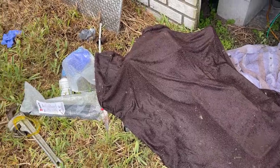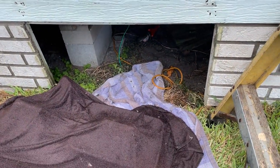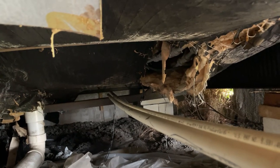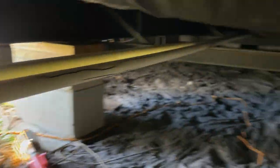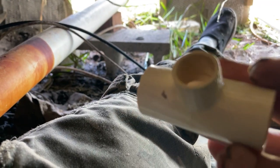We took a break for lunch and came back and it absolutely poured rain — I've got a towel sitting over all my tools. Here's where we're at: there are two lines coming from the water main where the water heater is, running into our main trunk line, shooting over to the bathroom area. I've got a lavatory, a toilet, and a tub to pick up back there. As we follow on down is where we pick up the other bathroom and the laundry, then we still have to go all the way to the other side with two half-inch lines to service the kitchen. I'm using three-quarter by three-quarter by half tees on the main lines to run over and pick up the different fixtures all along this trunk line.